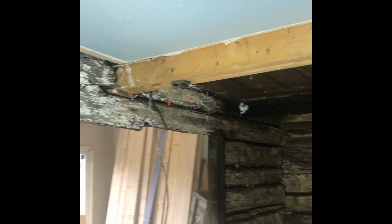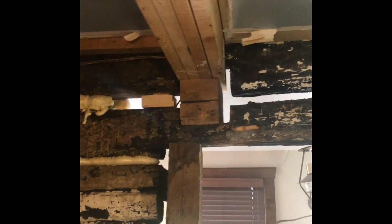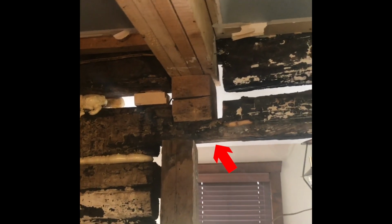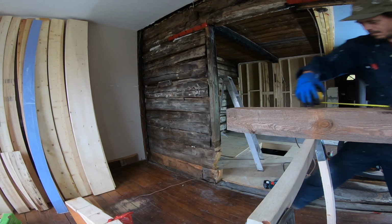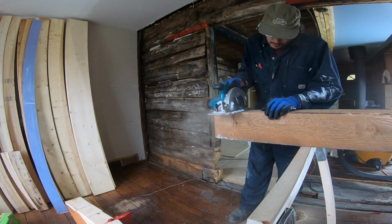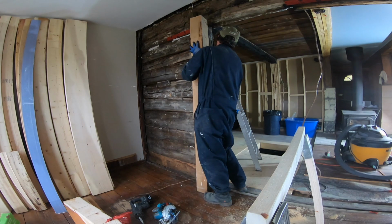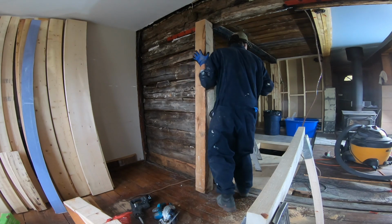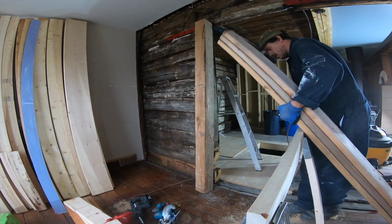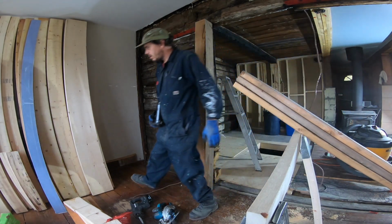Basically, that lower beam was supporting all the joists from the second floor, and at the end, there was that nice little piece of engineering, with an obvious weak spot. So simply removing the post wasn't gonna cut it. I definitely needed to add some support on each side and beef up that beam all across the opening. My first support column was cut and ready to go. I just needed to lift up the beam a little bit to make it fit snugly in there.